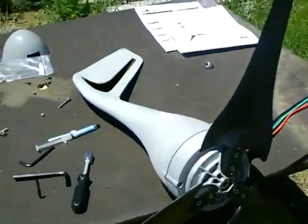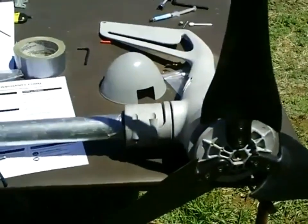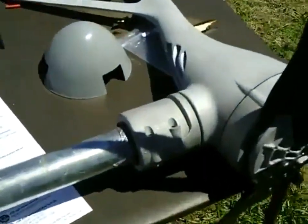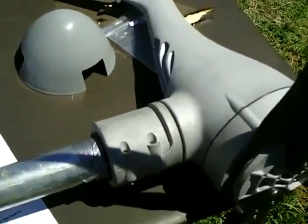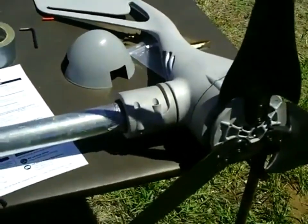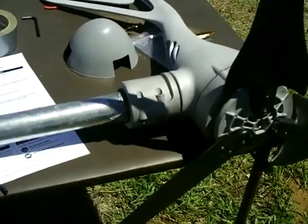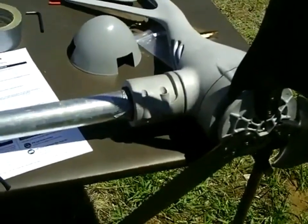There's wires coming out of the end of it. I now have the wind turbine connected to some Schedule 40 1.5-inch pipe — that's what's recommended for this system. They have a rotating cuff that when you tighten it down with the screws, it connects to the top of that pipe. There are three wires coming out of the wind turbine: a positive wire, a negative wire, and a neutral wire. If you're going to be grounding your wind turbine directly beneath the tower, you would use the neutral wire for that. Otherwise, you can connect the neutral wire to the negative wire as one wire, and those will run to your battery bank. I connected the two together and will be grounding them at the battery bank rather than right at the tower.